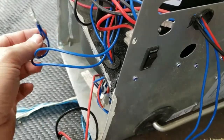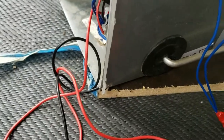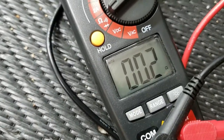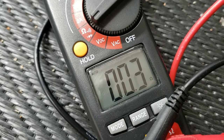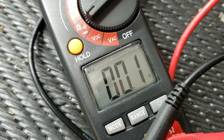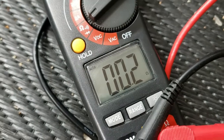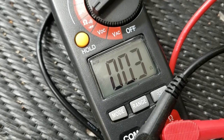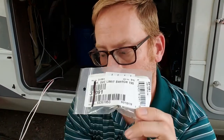The next test recommended by the Dinosaur website is to disconnect the wires from the limit switch so that you're only checking that switch. I removed all the plugs from the sail switch and the circuit board so I'm equivalently testing just the limit switch. They say that if the resistance is less than 0.1 ohms, the limit switch is probably good. It's kind of all over the place, which could be from the additional heat brought in by running it momentarily — it looks like this limit switch is outside of its standard range. I found a new limit switch on Amazon, so we're going to try to install it now and hopefully that's going to make this furnace work.